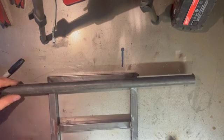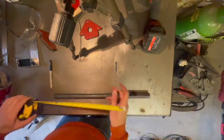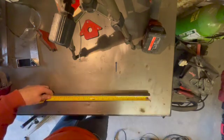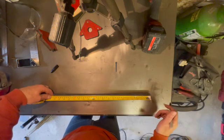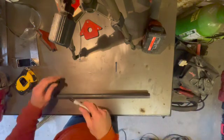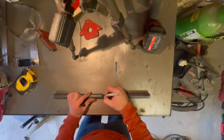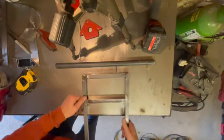Sorry, 30mm round, I should say. And it does have some awful sort of mill scale on it from when it was produced. So when it does go in the lathe, often the first couple of cuts are pretty terrible. But just starting by measuring out the centre of the axle here, so that I can then centre it into the middle of the rectangle.